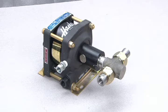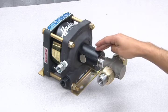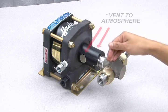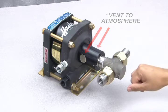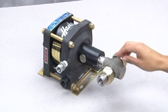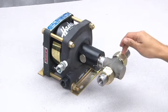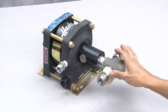The difference between a standard pump and one with a distance piece is that there is a separation between the liquid section and the air drive with a vent to atmosphere. In order to replace the seal package inside of the distance piece, you will need to remove the T-body by cutting the lock wire and unscrewing the T-body counterclockwise.